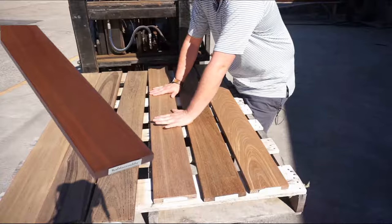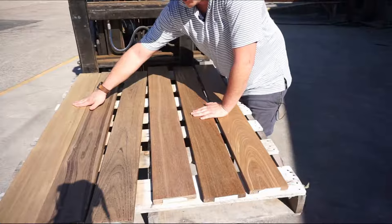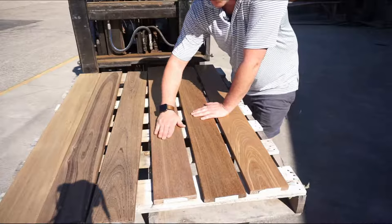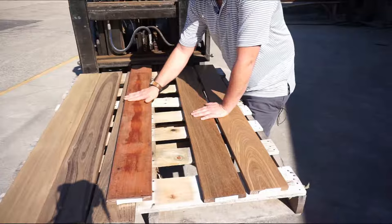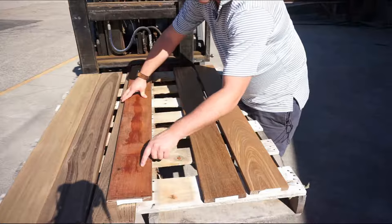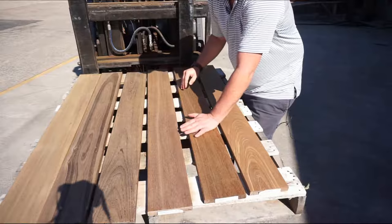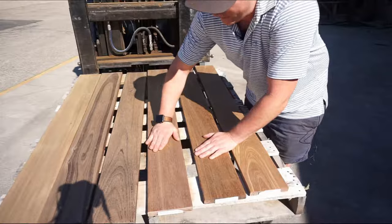This is Masarinduba. It started as a really, really pretty brick color — very consistent, very tight grain. It's still incredibly smooth but has certainly weathered out very nicely. Not so much silver like the Garapa, but substantially faded. You can tell it's definitely ready for some oil, but it's still looking really, really nice. Flip it over — there's some of the brick color. You can also see that because these aren't stainless steel screws, they have oxidized on the board a little bit, which is why you should always use stainless steel screws. This Masarinduba looks beautiful and it's going to look great when I put some more oil on it.